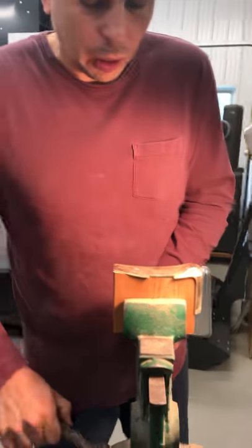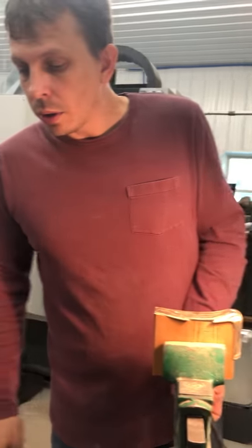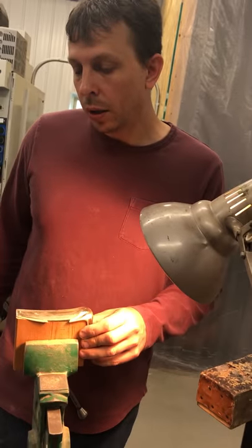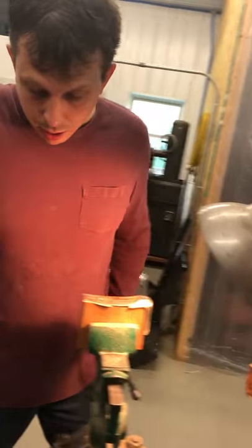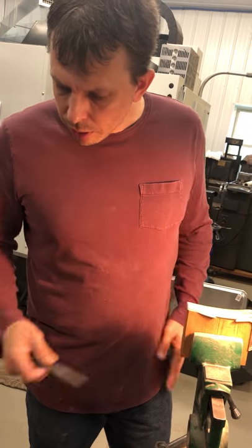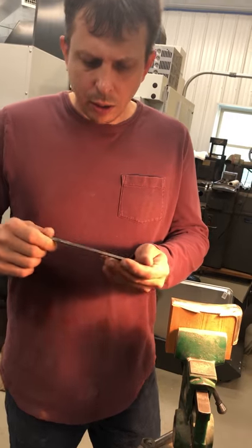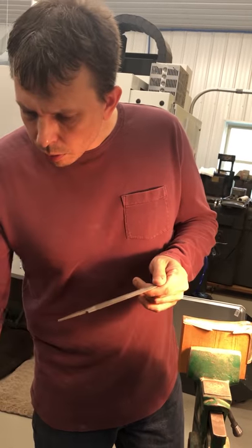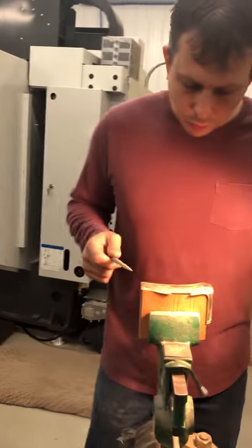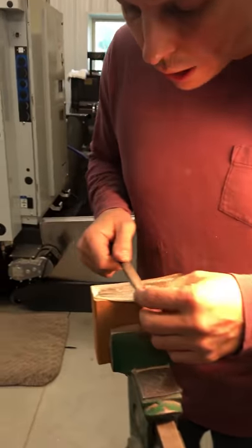That way we use very little abrasive paper, or we can use coarser grits of abrasive paper and more abrasive paper, and you know, eliminate the finer filing. We'll demonstrate a little finer filing. This file here is a bit finer. One of the problems with fine files is they can tend to clog a lot, so it's sort of a balance, you know. So let's just see what it does.